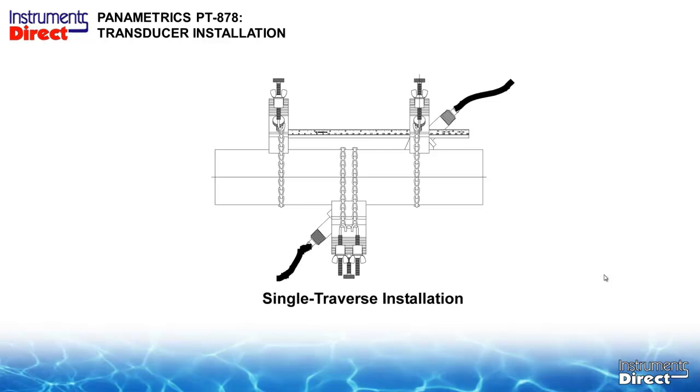For the single traverse Z-mount, put the standard clamp on one side of the pipe and a single transducer on the other side. On a large pipe application this can be tricky because you often cannot see the other side of the pipe. The suggestion is to mount the track with the ruler on one side, draw a line up to the top of the pipe, measure 180 degrees, draw a horizontal line across, and place the transducer on the mating side. Note that if you are installing on large plastic pipe, they tend to become egg-shaped over time, and you may have to prospect — move the transducer — to find the right location.